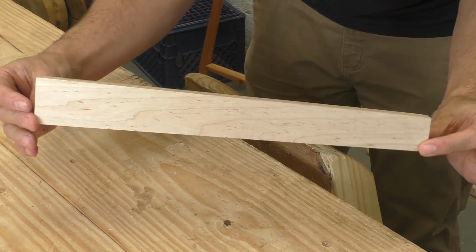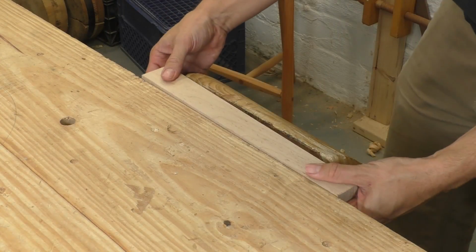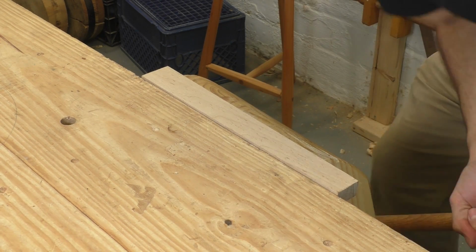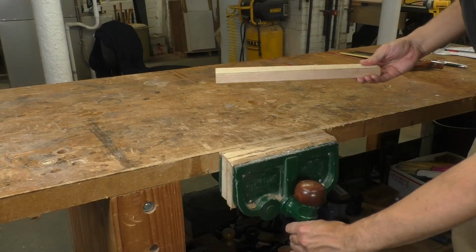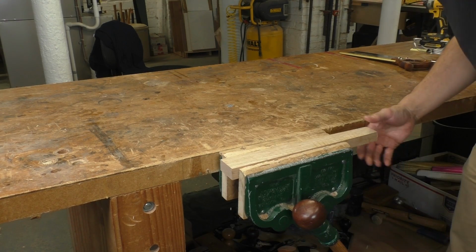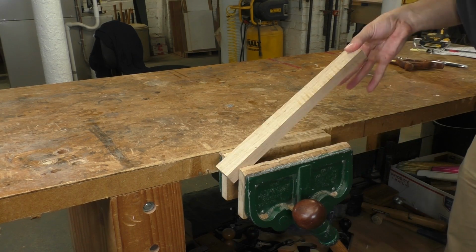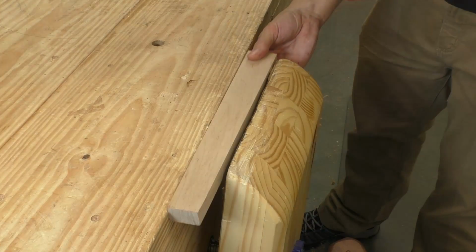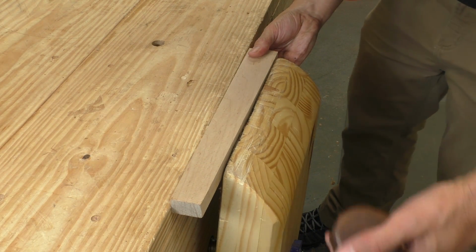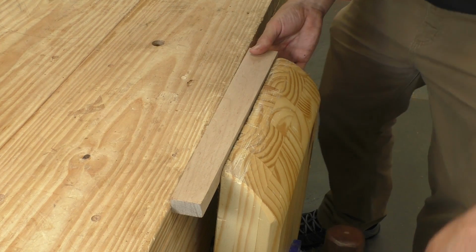Racking allows us to grip tapered and irregular pieces easily, and that matters a lot in furniture making, where lots of parts are tapered, like the legs of tables. Now, an iron vise won't grip these tapered parts without some sort of workaround, because it's too rigid. It can't conform to the piece. A leg vise, or any vise with a little bit of built-in racking, automatically conforms to that taper and holds even irregular pieces firmly.